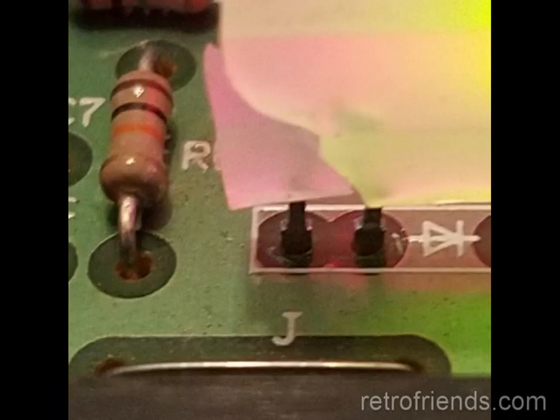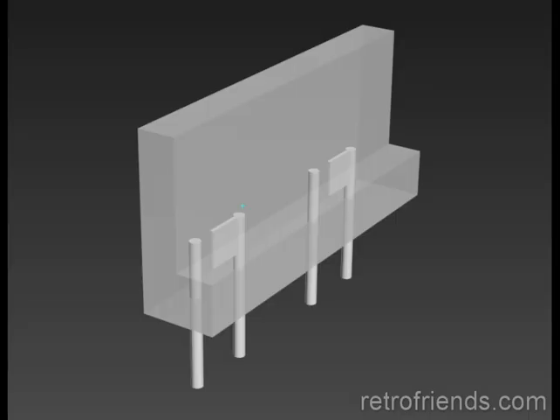The first thing I looked at was the LEDs. You can see the crack in the floppy drive LED that led me down the road to repairing this Amiga. I felt the Amiga had probably taken some shock damage, so I figured I should look for other broken components and solder joints. These LEDs are quite unique — there are actually two LEDs in each fixture, wired in series. The drive fixture had a crack right through one of its LEDs, breaking the connection.